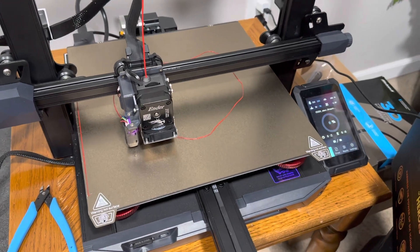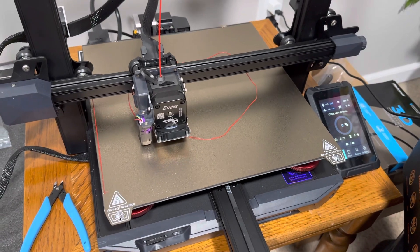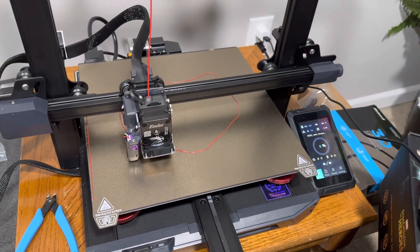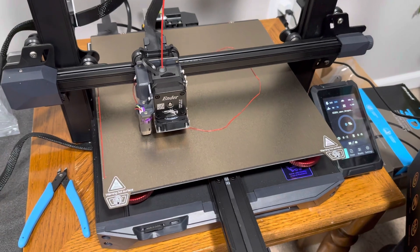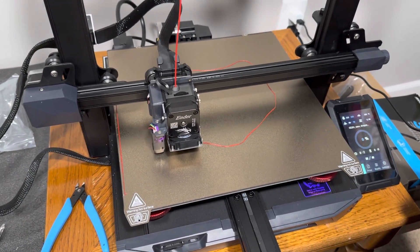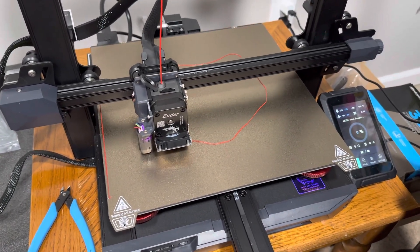I have also noticed, based off of someone's comment about the bed temperature, it actually does run roughly about 10 degrees colder than what the actual display says. So bumping up the heat bed to run it about 10 degrees hotter seems like it's the recipe to keep it to stick.